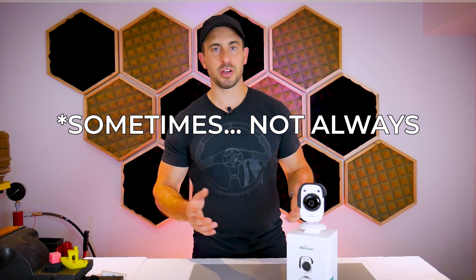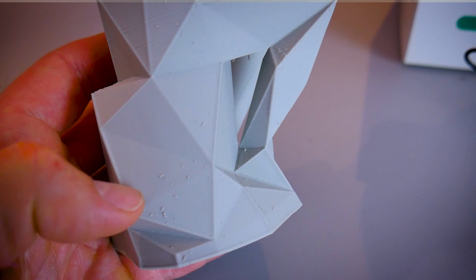The last thing is the quality of the part when doing time-lapse videos, and this isn't necessarily a knock against this device specifically — it's a general limitation of time-lapse with 3D printing. The print head has to move away from the part to take the photo. During that process there's a retraction, but you're not creating true negative pressure in the hot end, so you're not really sucking filament up — you're just doing your best to prevent oozing. Depending on how long the head is away, you'll get a little oozing, and as it returns for the next layer you'll always get a small zit or blob on your print. I didn't spend a lot of time tuning that out, so I do have zits and blobs on some prints.